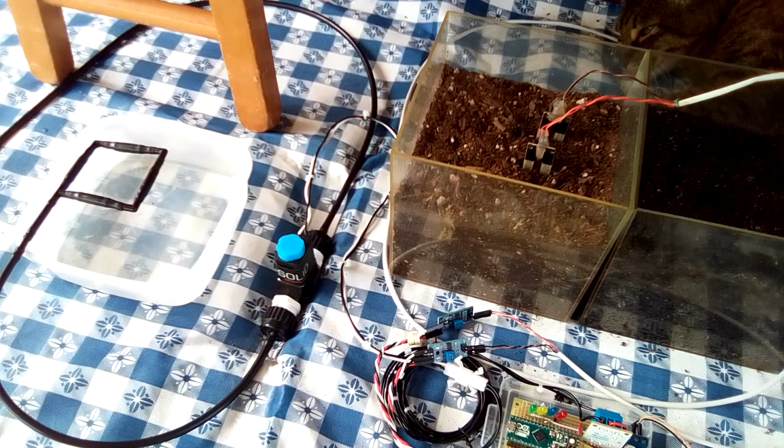The dry period is normally measured in days, but for development and today's demonstration, it is set to only 5 seconds. Should a sufficient amount of moisture be detected at either sensor during the dry period countdown, due to rain or a broken pipe, then the countdown is canceled. The red LED will go out, and one or both LEDs related to the moisture sensors will light.